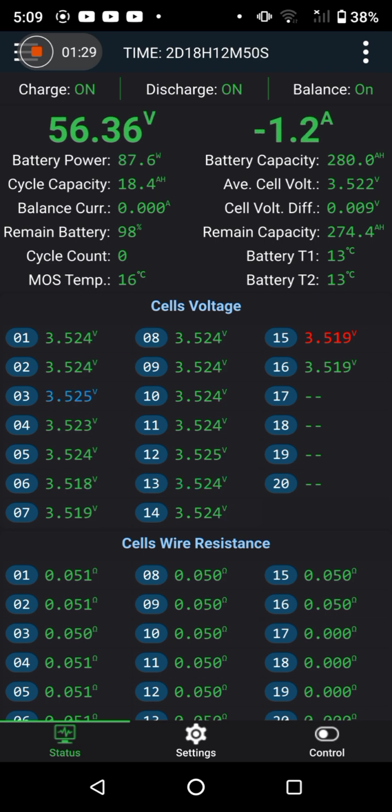I'm going to discharge a little bit, and not much. I just want to trick the inverter into going back into bulk mode and then into float mode. I think it's got stuck in its absorption mode. I was expecting the voltages to be slightly higher, but it's not a disaster. We're still right up there. So I'm just going to take a little tiny bit off the top and charge it back up at a higher amps, so to see what the balance is like.